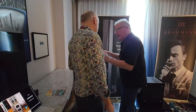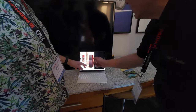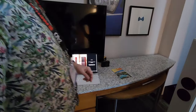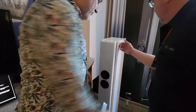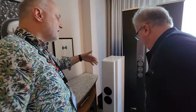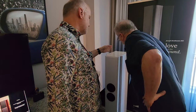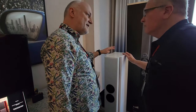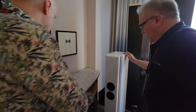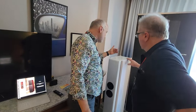So this is an extension of that. This was the second generation — the second generation had the horns on the side, then they moved parallel, so this is the third generation. What we use is we have a port on the lower part of the side — about that size. For every speaker, we calculate the board, that's simulated. We use the air between this board and the cabinet as a driver. When you play decent bass, you see the flame dancing here. The adaptation to a room is better the bigger the air mass in the bass — it couples more efficiently. We have a huge area, and the driver is made from air, so to say.